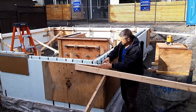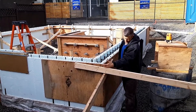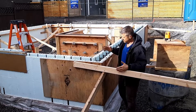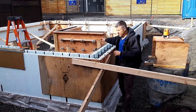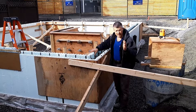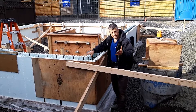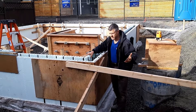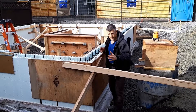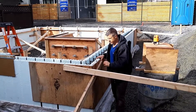The videos they show don't show this corner bracing technique we've done. Once we brace it and square it up, we put these corner brackets on — three-quarter inch plywood, four-foot sheets — and this really holds the corners in. Typically they just show you bracing on the inside of the walls, but in my experience the walls haven't been very straight and they've gone out a bit. The blocks are not always exactly the same. If you can get this thing braced, it doesn't take that much time and it keeps the whole foundation square. On higher walls they will go out — I can guarantee it.